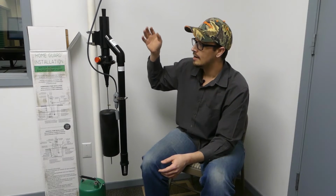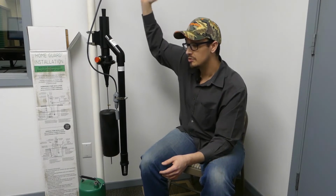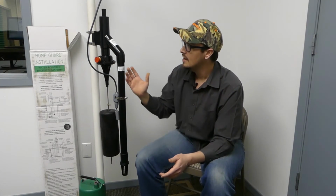Oh, and then the final thing that you might consider adding is a backflow preventer. In some districts, you'll probably want to consult your local code with regard to whether that's actually required, but it is definitely recommended because, again, you're pumping sump water through this unit, which is mixing with fresh water to go out to your waste system. And so there is potential for contamination if something were to go wrong. So a backflow preventer is going to help keep any contamination from getting into your house and potentially tainting the water supply.